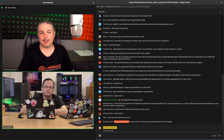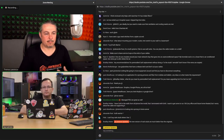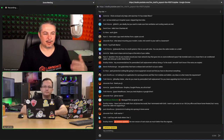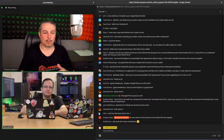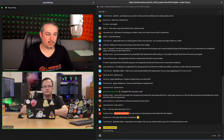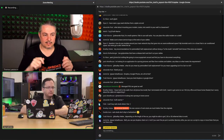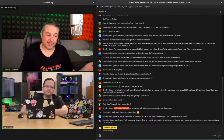The most frequent question we get is: 'I'm building or wiring a new house — should I just run fiber everywhere to future-proof it?' Absolutely not, probably. Fiber is faster in theory, but it's not easy to work with, doesn't terminate as cleanly as RJ45, and adapters aren't universally accepted. Even in 2021, after fiber has been around 20+ years, you still want to run standard copper cabling.